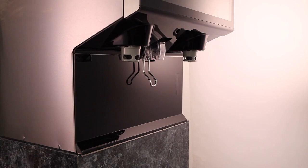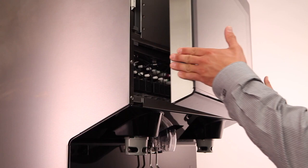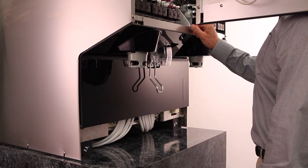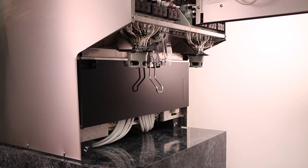Carefully slide the IDC Pro onto the counter. Be careful not to scratch the countertop, and ensure that you do not pinch the lines while moving the IDC Pro onto the counter. Do not plug the IDC Pro in at this time. Once the IDC Pro is set in place on the counter, remove the tape which holds the door shut. Open the door by gently pulling on the bottom left hand corner of the screen and gently glide the door open. To remove the nozzle cover, first remove the thumb screw from the frame cross bar, then grasp each side of the nozzle cover and pull towards you in an upward motion. Once removed, place the thumb screw in its original hole for safe keeping.